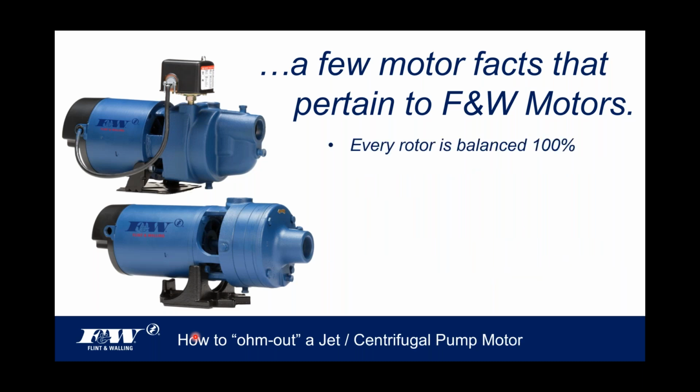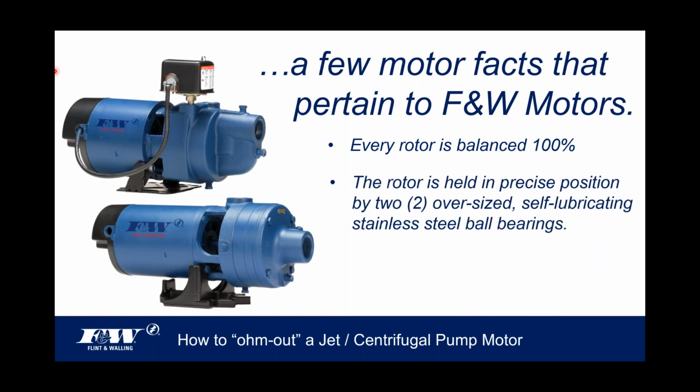Every rotor, we die cast our own rotors, so I want you to know every rotor, which is the portion of the motor back here, it's the portion that turns, right? I want you to know that we balance every one of those 100%, and then the rotor is held in place, you'll see this in some ensuing slides, both front and back with two large oversized self-lubricating stainless steel ball bearings. That all said, this motor runs very, very quiet. Of course, every motor is going to be factory tested, 100% every motor.